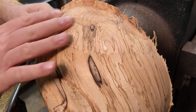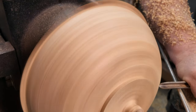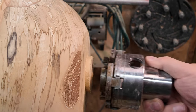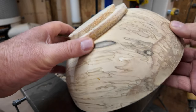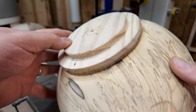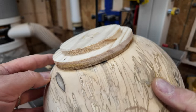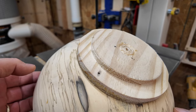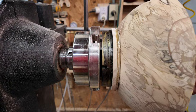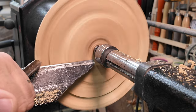My apologies. The only way out of this without losing any more content of the bowl was to make up a sacrificial chuck and glue that on the bottom of the bowl. Naturally, the sacrificial chuck wasn't positioned completely central on the bowl, so the outside turned in one dimension and the inside another. So we ended up with adverse thicknesses of walls opposing each other.